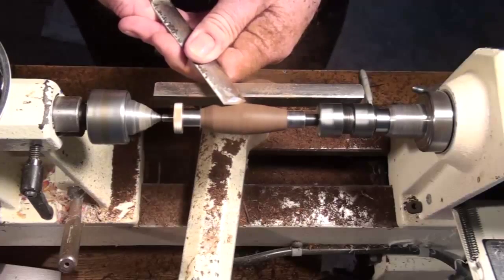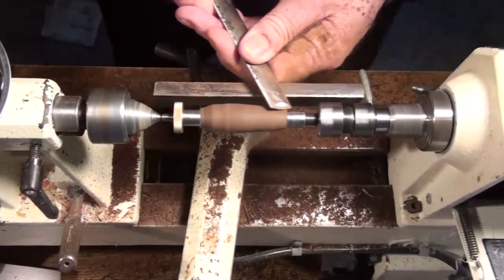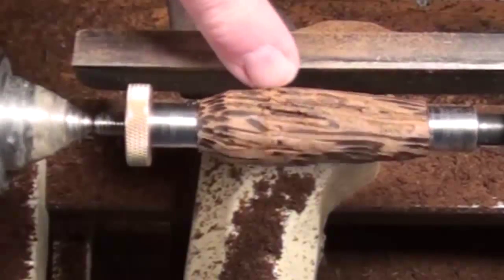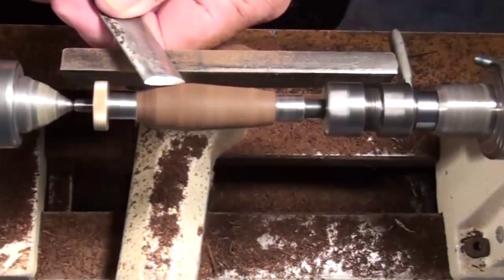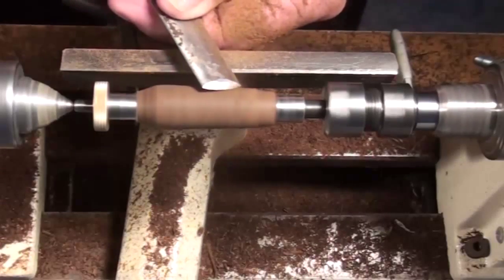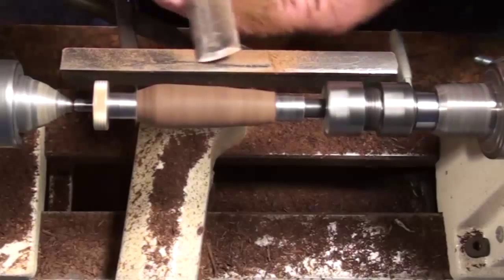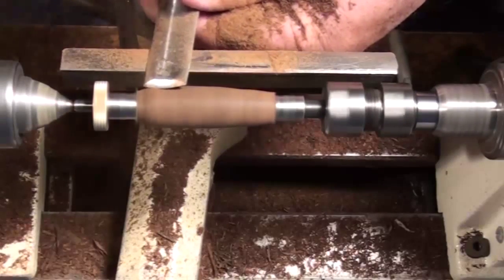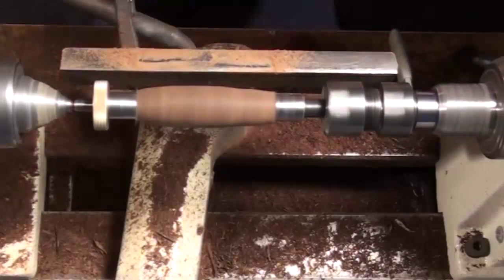This looks like nothing more than turning, but it's actually kind of interesting. This is a pretty sharp tool and I'm doing pretty good turning, and yet when we stop and look at the blank, you can see that parts are chipping out as I'm coming across them, even though the tool is sharp. I'll try going the other direction — in one direction it was a little bit better — so I started using just that one cutting direction. But as far as did it do the job? No. I continued to have trouble with chipping out parts of it. When I stopped the lathe and looked at it, you can see that there are a number of areas that are not nicely turned. This is when we start to realize it's going to take a little bit of additional reinforcement.